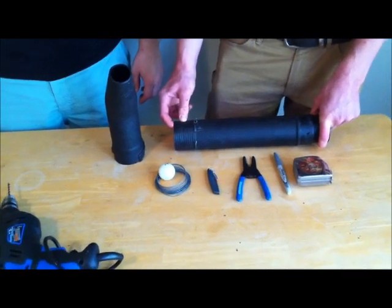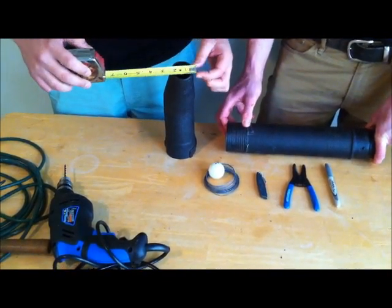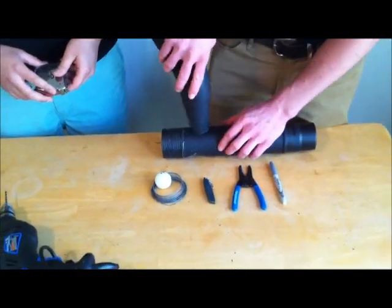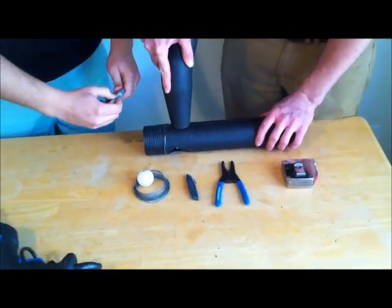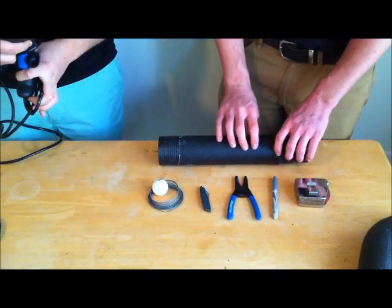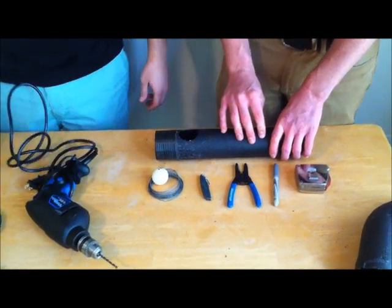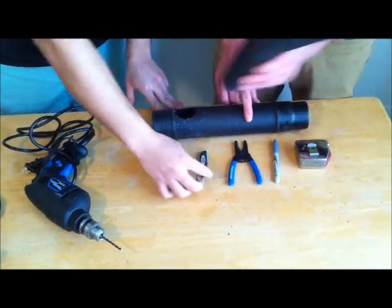In this phase we're preparing the barrel installation. We recognized that this accessory here fits perfectly for the ping pong balls so we do not have to find a separate hopper. We took the barrel we were going to use, laid the accessory hopper onto it, took our sharpie and outlined it — giving us a general idea of the size of hole we needed. We then took the drill with about an 11/16 size bit and drilled circular holes, since we didn't have a hole saw. After that, we used a serrated blade to cut open the hole to about the size of the barrel assembly.